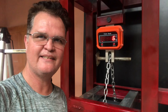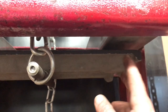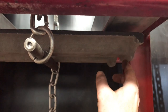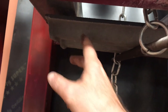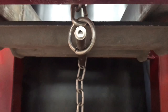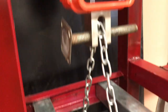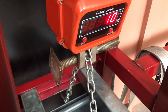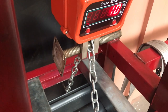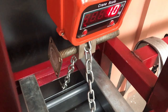We're just set up here with the next test on this cement tile. The cement tile has the bar in the middle, about the same distance apart as it might be on your roof. Your batten timber is about 50 mil wide and it'll run through underneath here behind these hooks. This is your overlap on the other tile. That's about right for where you might put your foot. I made sure it was level this time before jacking it up. The steel beams weigh a little bit extra, so in total that's 10 kilos — you'd probably take 10 kilos off your result to be slightly more accurate.